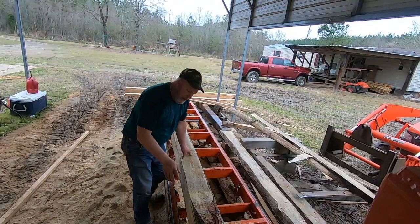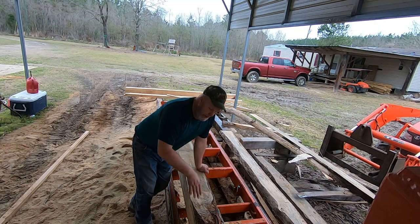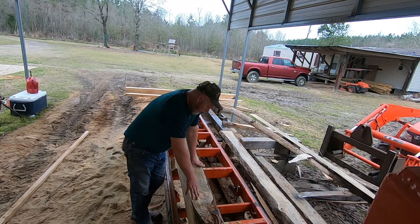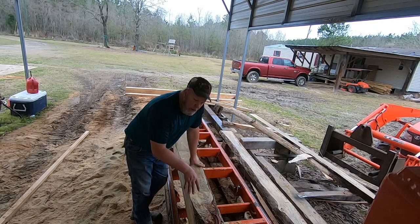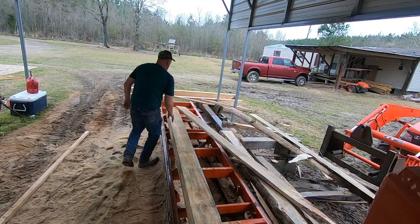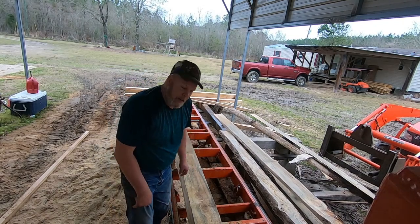What I'm talking about is cutting on sixes — what I showed you on the scale — that is an inch and a half thick; they've got it laid out already on your lumber scale. Now see how this one's got some bark on each side? It's not perfect. This is actually a two by eight, but I need some two-by-sixes, so I'm gonna cut it down. I'll throw it on this side and cut it again when I cut my trash later. Now I got a perfect side right here, so I'm gonna flip the log and cut it down to five and a half.